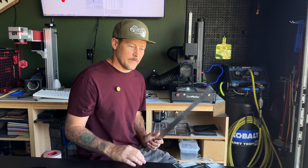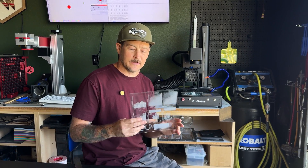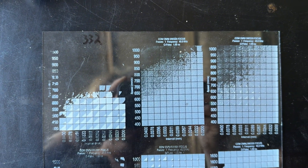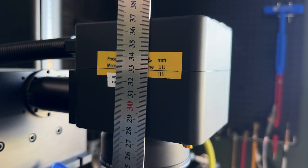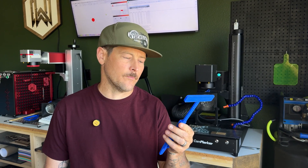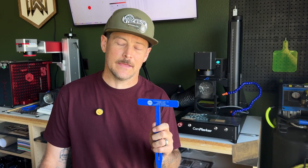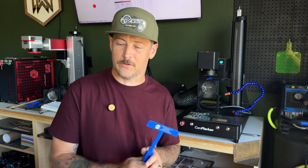After the sizzle-and-spark test, measure your distance and check where your line is. I was very close to the recommended 332, so I started from there. I then ran material tests at all different focal lengths above and below that range, and found a focal distance of 330 to work best with the glass. I'm curious what others are using — leave a comment. I then printed a focal stick from JMac on Maker World called the 'Big Scary Focus Stick.' It's adjustable, comes in different sizes, and is super handy if you have a 3D printer.